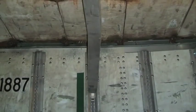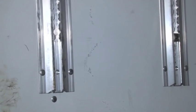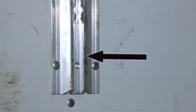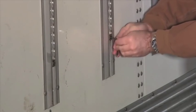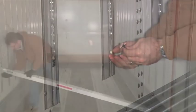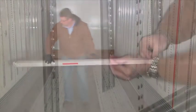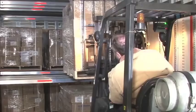If beams cannot move in tracks or if they're bent, broken, or punctured, they should be replaced. Slightly bent or non-punctured beams which can move freely do not need to be replaced. If a beam is damaged or not working properly, the beam should be replaced. The decking system has a machined slot at the bottom of the track. This slot allows you to replace the damaged beam with a fully functioning beam by simply removing the beam stop, sliding the beam to the bottom of the track, and inserting a new beam in the track. Ensure that you replace the beam stop after the new beam is installed.